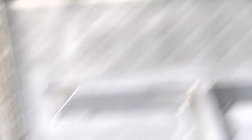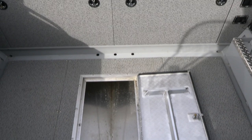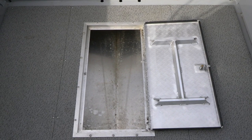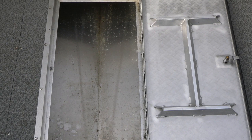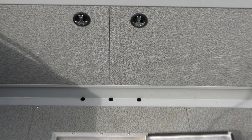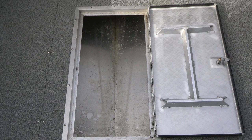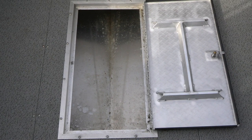I love the fact that there's a macerator pump up there. You have the option to set this fish box to drain right into the back of the boat — that's the default, which makes sense if it's raining so that water drains to the back and hits the automatic bilge. But if you're putting fish in here, you can imagine the goo that builds up as you bleed fish — you don't want that having to grind through your bilge making everything nasty and smelly. There's a knob that sits behind those little doors that you can switch to the macerator setting, meaning it drains into that pump and actually pumps out the side of the boat. All that fish gunk gets deposited right back into the water and you don't have to deal with it in your bilge pump.